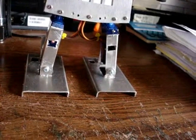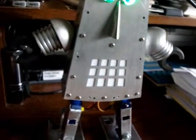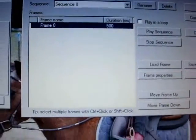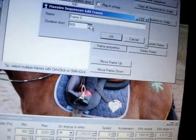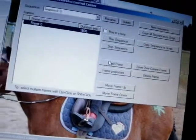It's alright for the eyes to start as being green. You can see if you move the one that says arm... I'm going to start with them in the center position. I'm going to call this my home position, so I'm going to hit 'Save Frame Zero' right here. And when I hit that button, it should appear over here — and there it is, frame zero. How long that frame runs before it goes to the next frame, you can adjust by double-clicking on it. You've got your duration in milliseconds — that'd be a half a second. It might be nice if the home position ran longer than the next step so you can tell it apart.